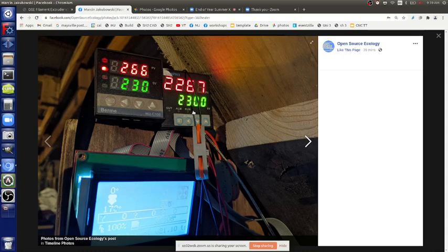That's called hysteresis. Over time, the logic is called the PID algorithm, proportional integral differential controller system. That's what these little controllers have built into them. I don't know about the exact details of what parameters they're using within that, but if the algorithms are working, you should stabilize to some known temperatures as set.